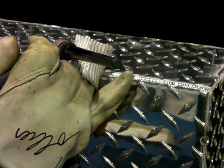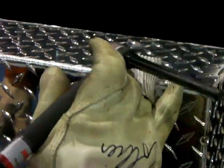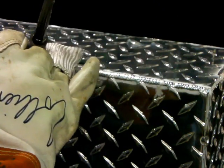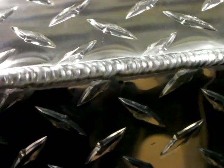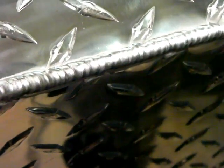You can see the frosty band of cleaning action extending about a quarter inch away from the edge of the bead with straight argon. Without changing the AC balance, but using the helium mix, we got very little cleaning action outside the joint. And that's a good thing for some jobs — some jobs don't want that cleaning band on nice polished aluminum, especially marine hardware and things.